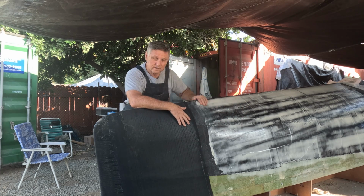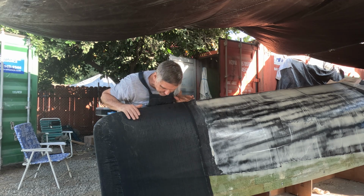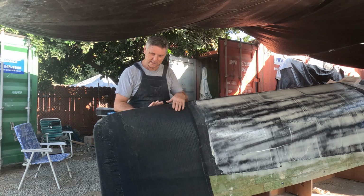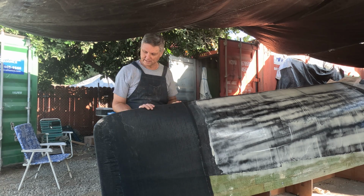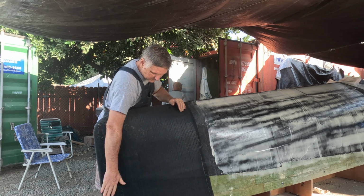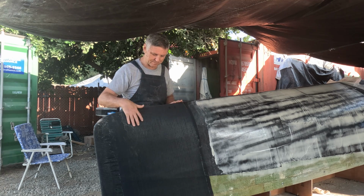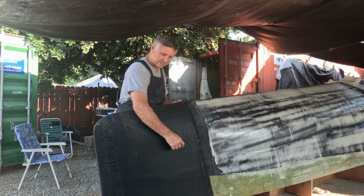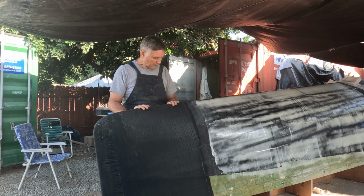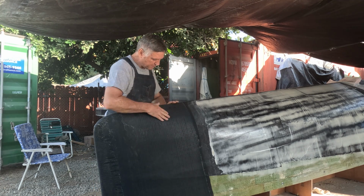So as you can see, we've got our fairing compound from yesterday on there, but today we went ahead and took the peel ply off the bow here, and we're going to go ahead and put fairing compound on the bow, and it came out pretty nice. So this should be nice and strong here, since we had thinned it up a bit. We added these couple extra layers that weren't called for in the plans up here, and that's simply because we took out some of that laminate when we were sanding it, so we put basalt on to replace it. So it's all good, and the front looks good. It's all nice up here. So we're happy with how this all came out.